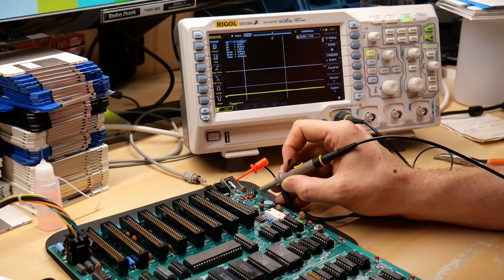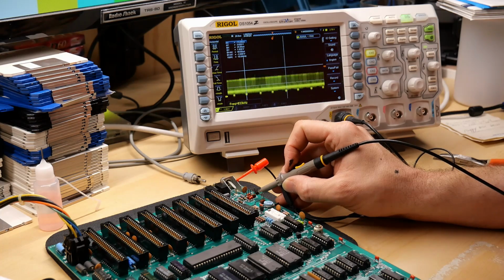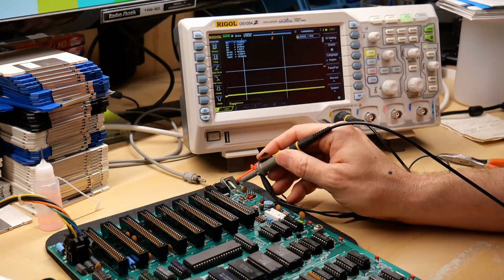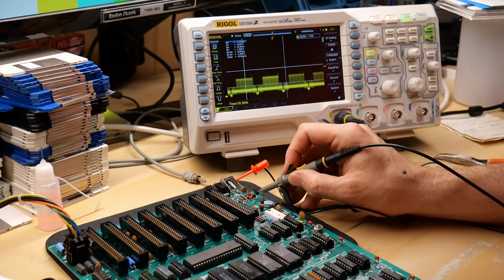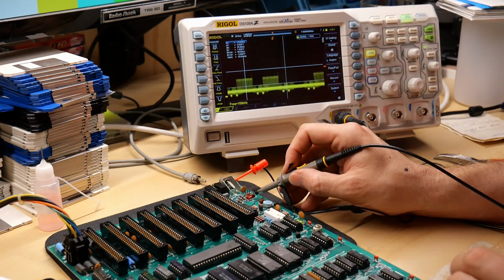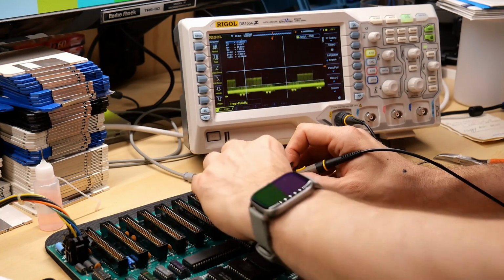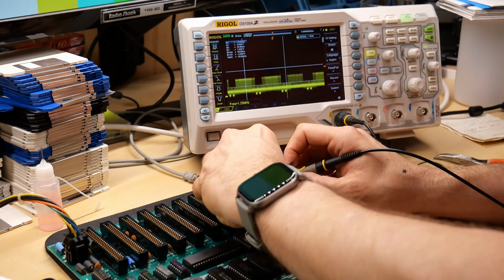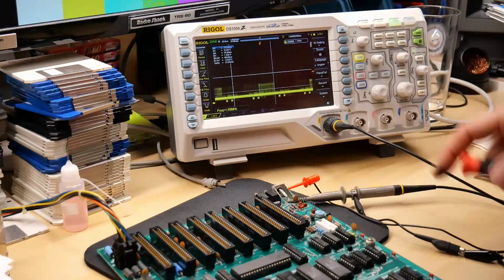And that's got negative voltage. There it is, there's a video signal right there. Why is it not getting from there to this connector that I had the monitor plugged into? That's unusual. Yeah, I'd say that's a video signal right there. I think if I adjust this potentiometer, I think it should change the amplitude. Not really seeing any change. Okay, and now we have a video signal.